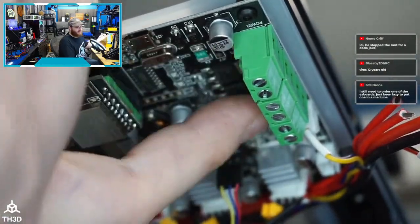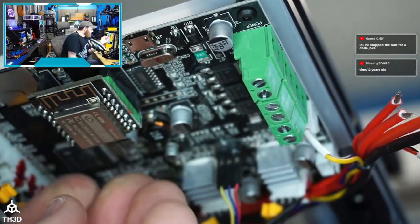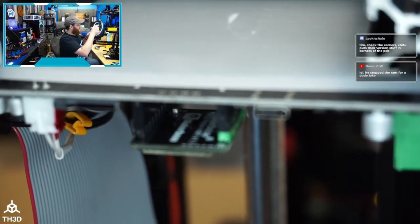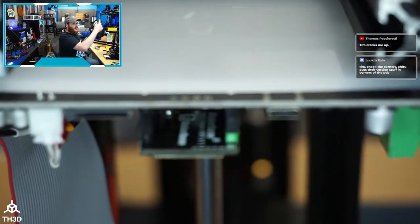These are great MOSFETs. Looking at the ESP8266 module — this is hot-glued in but it does say on the back: MKS Robin, MakerBase. So I'm assuming this is a modified Robin board. As I've mentioned on the channel, MKS does a lot of white labeling for other companies — if I'm building a printer and need a control board, I can go to them and they'll make a customized version of one of their existing designs. That's likely what this is — a variation of their Robin board.